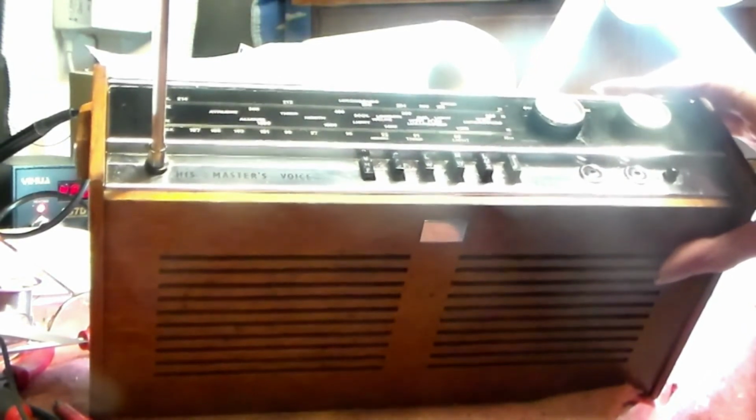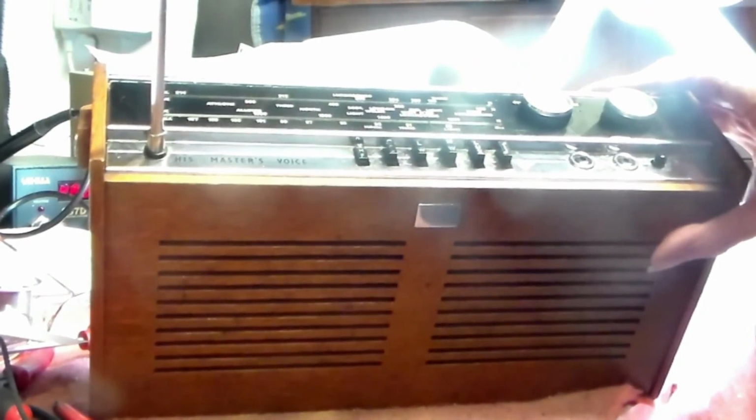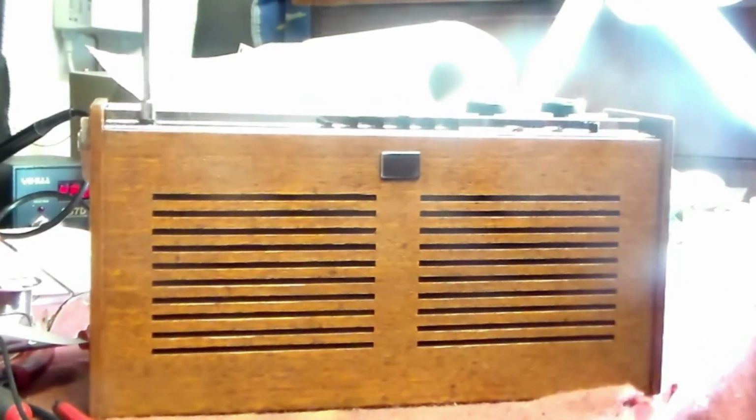That works for amplifiers. Now, an oscillator is basically an amplifier that feeds back. That's why capacitors on IF stages and RF stages, as well as AF stages, on the cathodes, or the link to earth on a transistor, what we do, we put a capacitor across the resistor to earth, is they put in what's called negative feedback, which reduces the gain and stops it going into oscillation. When it goes into oscillation, the amplifier then becomes an oscillator.